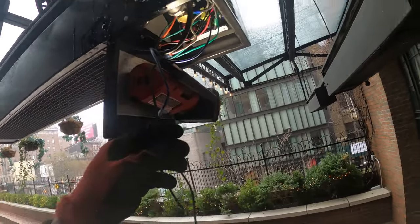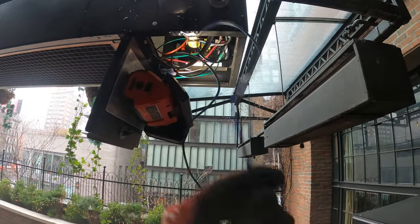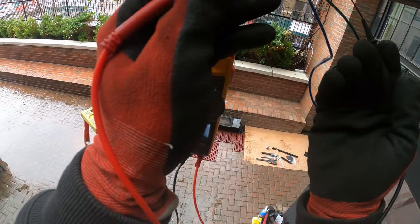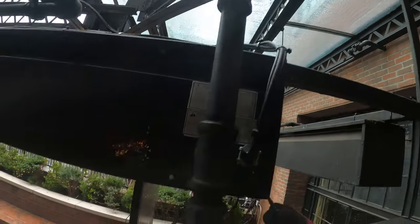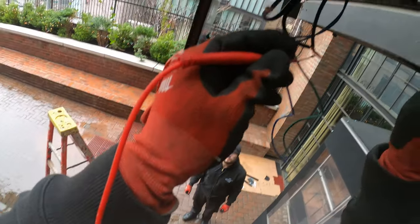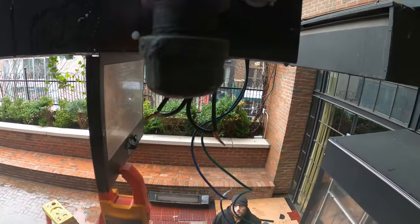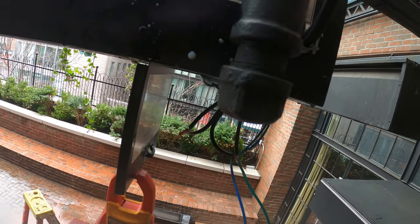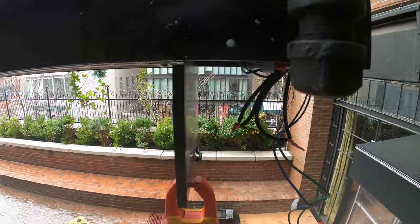We've got to wire our 24 volts — these are going to be these two wires. Let's go ahead and get all these spliced together. I just had my partner turn on power — we've got 24 volts. I want to see who's the hot line. This one's our 24, and it says blue 24 only. So I'm going to put the blue to the hot and the green to the common.